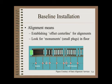Aligning a machine involves first defining a centerline. For new machines, this means positioning the machine in a building. For existing machines, the crew must find the positions and squareness of major parts, then define a centerline using an average or using the part most difficult to move. The last step is to move that centerline into a precisely offset parallel located in an aisleway for convenience of measurement. This offset centerline is usually marked by brass plugs with a pinprick — sometimes called monuments — and the line connecting them is called a baseline or offset centerline.